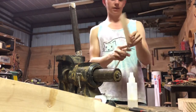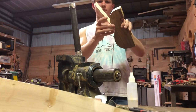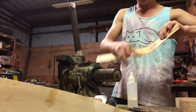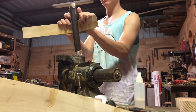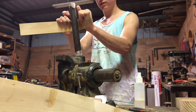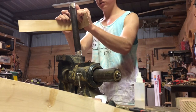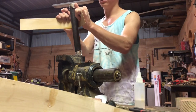As you can tell, it's definitely getting a much more aggressive bend now. Still not to that shape yet. So, the next part of the bend. And every time you hold it down there, see where your ends will be lining up, so you can see which side you want to bend it more on, so you don't get one end that's too short and one that's too long.